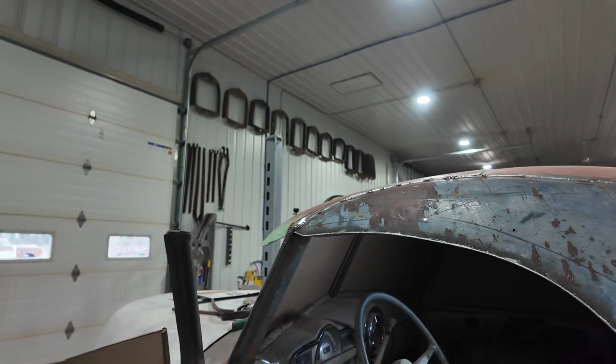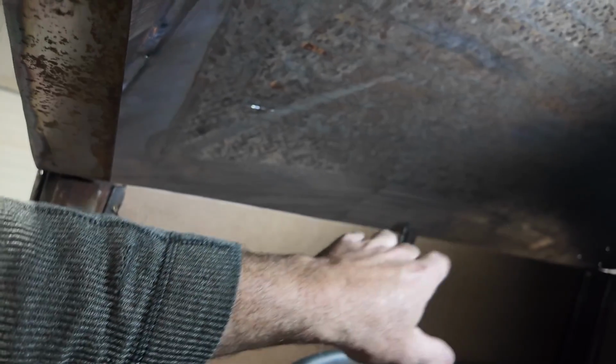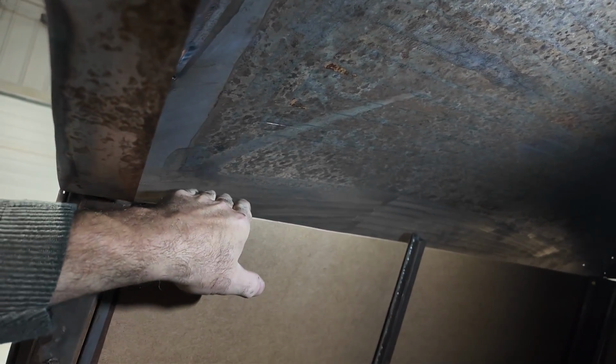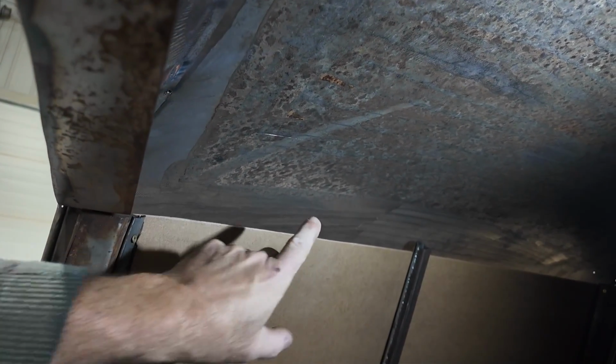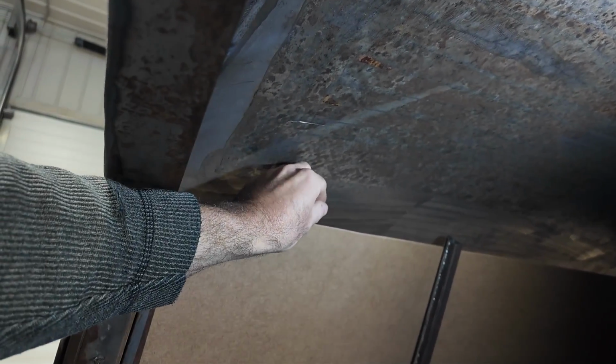Yeah. This one's going to be interesting. Somehow I'm going to have to trim that side, the center post down, and I'm going to start just building, like, somehow I think I'm going to go flat across, build another shelf up here, like a header panel. It's going to go across so we can put a rubber that'll sandwich on top of the glass all the way across. Maybe if I do this thing going across, we'll be able to latch it in the middle and the sides. Not 100% how I'm doing that yet.